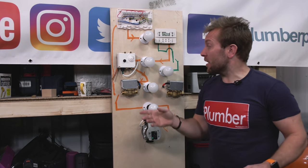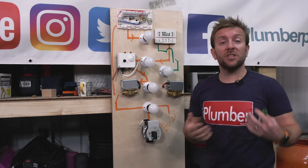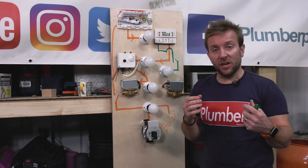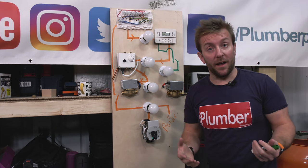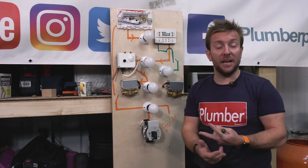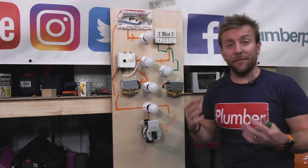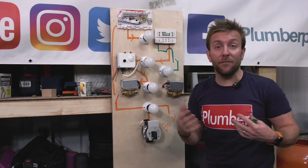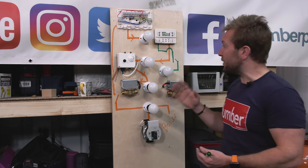Now, like I said a minute ago, the room thermostat does exactly what the tank thermostat does. That switches on and off according to the temperature in the room. Now, these days, sometimes you can actually get a room thermostat and a programmer all in one. Things like Nest controllers, Drayton My Genies. And the good thing about all these different things is they always come with a full schematic drawing for you to follow along with, if you've got any different things going on or you're worried about things to figure out what's happening. This is like an overview video for you.